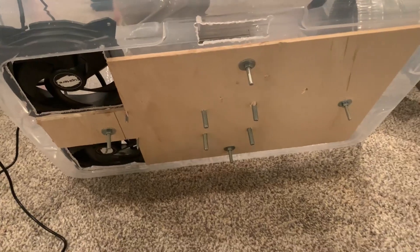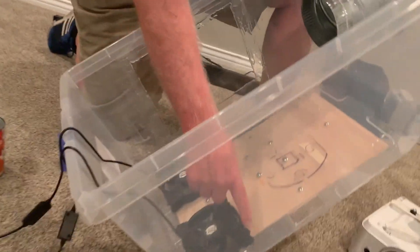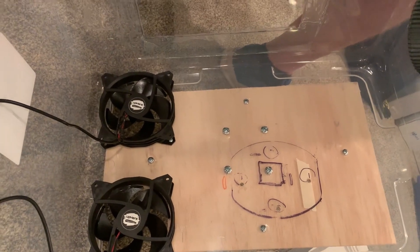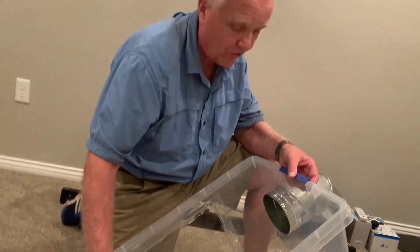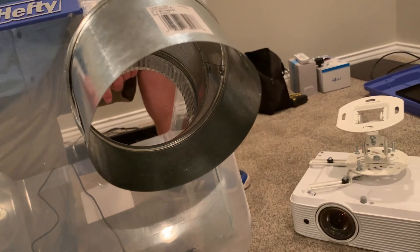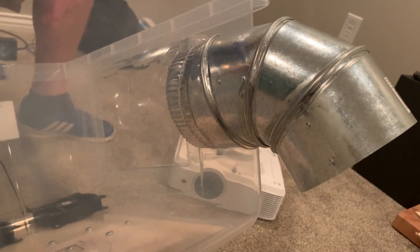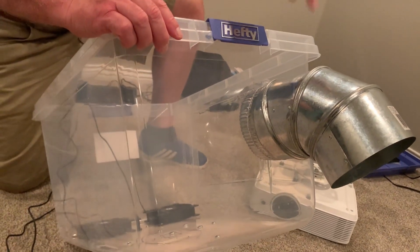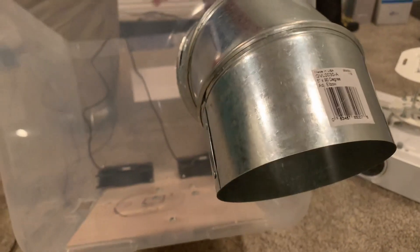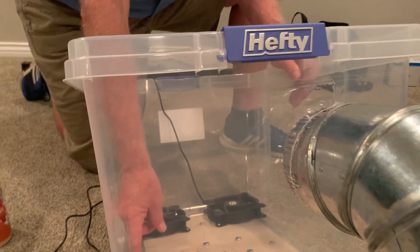The reason I chose to put fans at the bottom is that it's the easiest way to waterproof. You can put fans on the side, but there's a slim chance that when it's raining and wind is flowing in the direction of the fan airflow, you might end up pulling in some water droplets. I prefer fans at the bottom sucking cold air in. As for why I don't use the fans to push air out — I already have a vent to the side of the box and extremely strong projector fans pushing air out, so adding a slower $15 fan would only slow things down. During November and December temperatures are pretty low, so bringing in even a little cold air works.